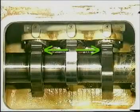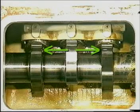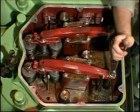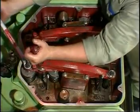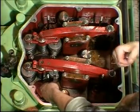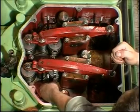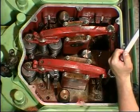Turn the piston to top dead center and check that the rollers rest on the circular part of the cams, in which position both the inlet and exhaust valves are closed. Loosen the adjustment screws on the rocker arm and on the valve bridge of the inlet valve. Insert the 0.4mm feeler gauge marked correct between the spindle and valve bridge nearest the rocker arm bracket. Tighten the adjustment screw until the correct clearance has been obtained and then tighten the lock nut.